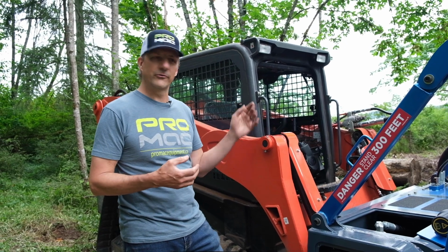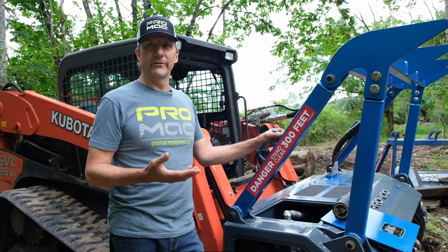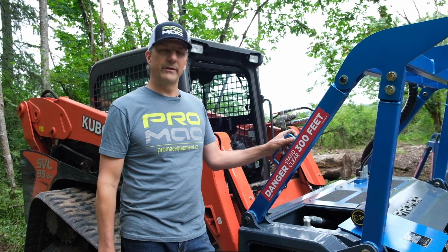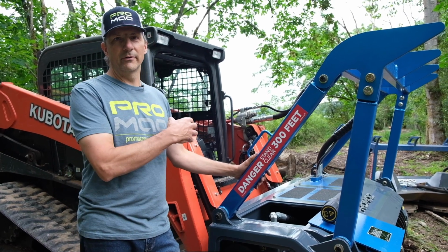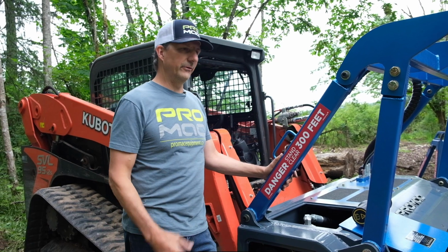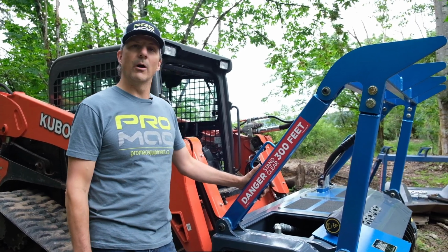As soon as you shut the pressure off to the mulcher, there's a certain delay, usually 5 to 6 seconds, and then it takes around 10 seconds, all adjustable, to come to a full stop, so it will not continue to spin. It also does not hinder the operation of the mulcher while you're mulching. Because of the way it's designed, if you're starving the mulcher of pressure, it will not start to brake, which is always a problem without that particular type of system.